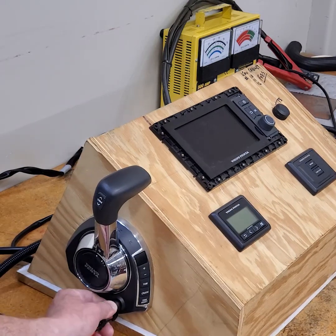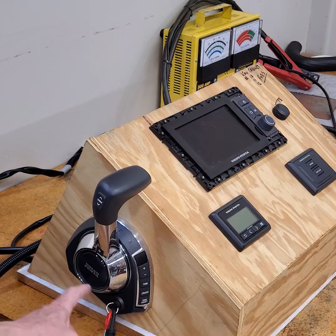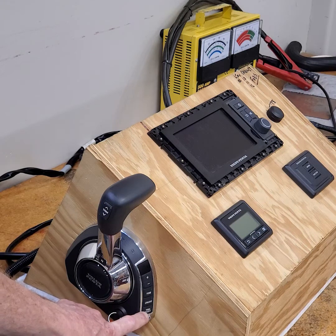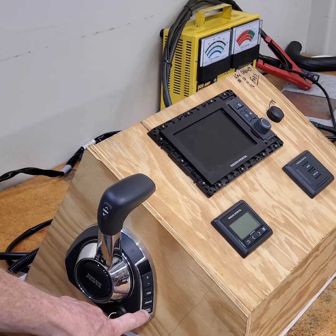The emergency lanyard is something you definitely don't want to lose, so it's factored right into the side mount control. Your power trim switch is here, and your options for trim assist — that's power trim assist — allow the drive to move at set predetermined points.